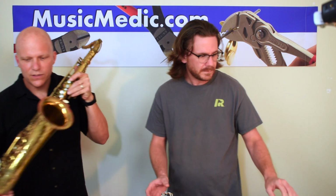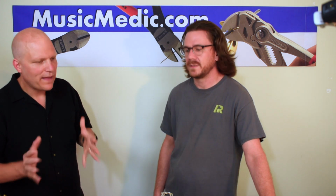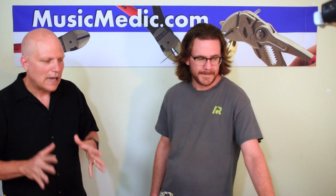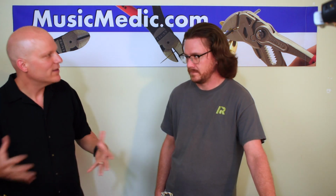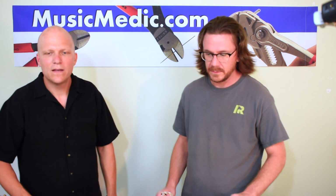Great, so that allows you, when you play your low B flat, if your pinky accidentally hits the C sharp, that stops the low B flat from cacking. And when that happens, your low notes are not going to play. Right. So having an adjustment that's quick and also stable will allow your low notes to come out and hold your C sharp closed. Absolutely.